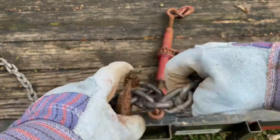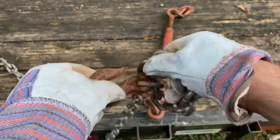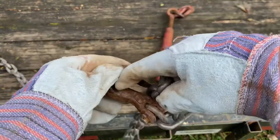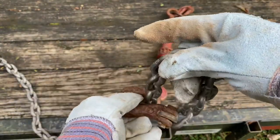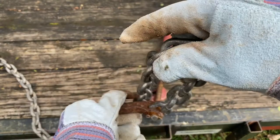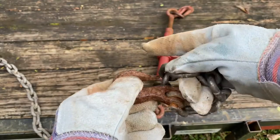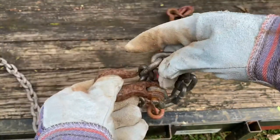All hooks are designed for the chain to be pulled all the way down to the throat. Now there are some big curved hooks that will go all the way around the chain — they're called slip hooks. They'll have a wider throat and can go around the chain, but what you have to watch with them is they actually slide down and tighten like a noose or a slip knot. That's how you connect the chain to itself.